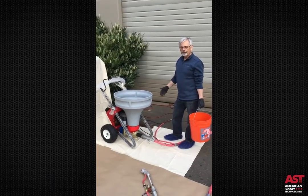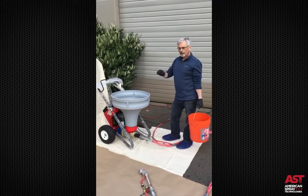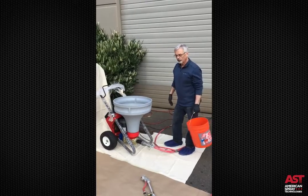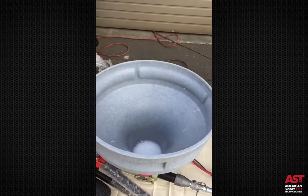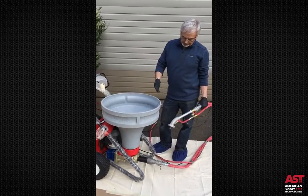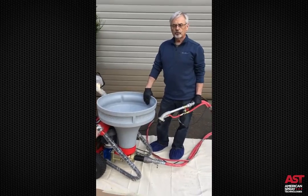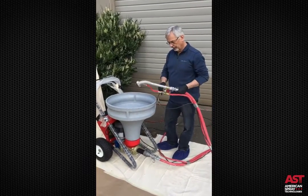When you first start a pump on a brand new machine, the hose is dry. The material that goes through will progress through in a dry hose and the head of it will tend to dry out. You can overcome that by wetting the hose — just a little bit of soapy water. Soap is a good lubricant and helps the pump spin. What the pump doesn't like is petroleum products — the stator tube is natural shore rubber and will decay if exposed to oil, grease, or WD-40.